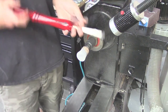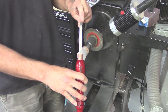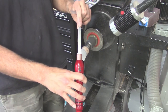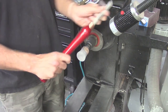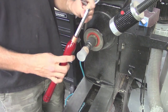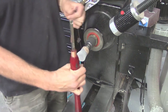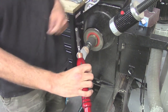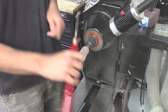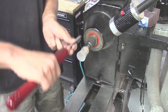If somebody asked me, you can get away with just buying one of the round carbide tools. And I'm not even necessarily going to say you've got to go buy Easy Wood Tools. We were just talking about the negative rake cutters, which I think are awesome. If you're going to turn resin, that's a good way to go, so the Easy Wood Tools make sense. But you can do so many things. You can do the outsides, shaping spindles. You can hollow with this one.